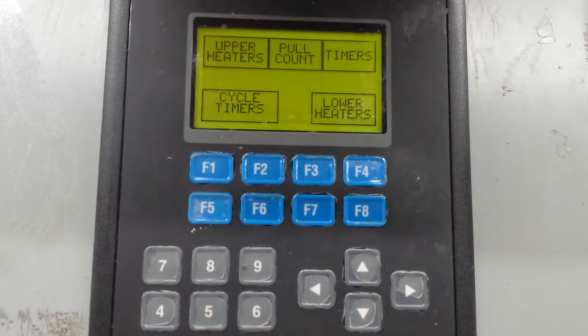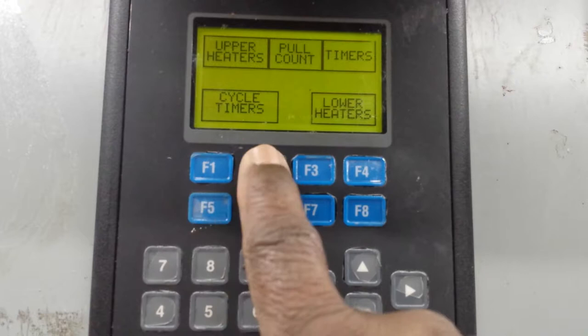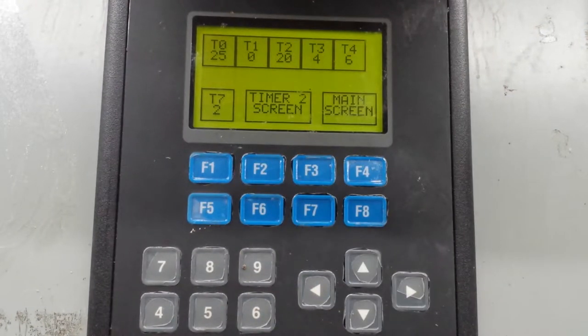F7 gives you that, and then you see upper heater - you know that already. Now you want to go back to your timers. You go to F3, because this is box 1, 2, 3 which is 1, 2, 3. F3 gives you T0, T1 - these are the timers. That's what you keep on doing. Now there's a little catch I want you to know - it's about the fan. When you check the book, it will tell you about, for example, T11. T11 is the mold cooling timer.